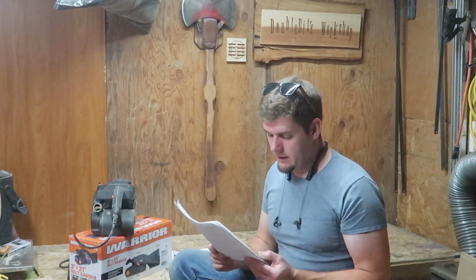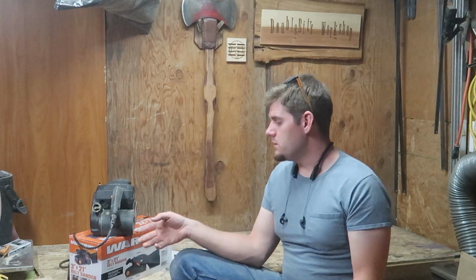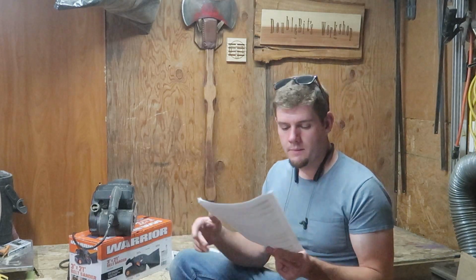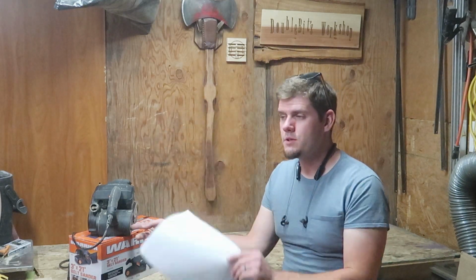It comes with at least one belt, which is nice, and it's a 120 grit, so it's a nice in-between. It's not something super fine, and it's not something so gritty that you're like throwing on a 30 grit or a 65 grit or some kind of odd, I think it's like 35 and 60 grit are the grittiest that you can usually get for belts on these, and a lot of times you have to order those. I don't think those are on shelves. Anyway, so it is nice that they had a 120 on here to begin with. I burned through that pretty quickly in the porch project and ended up using a lot of 80 grit just to get a lot of the roughness down generally, and then I went back through it with the palm sander, me and the wife did, and made sure it was nice and smooth.